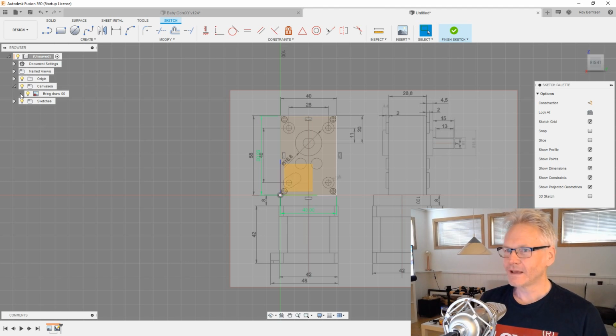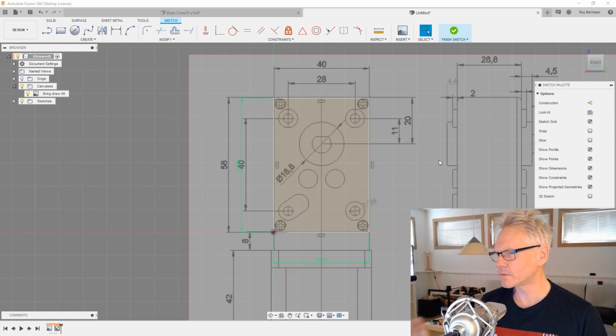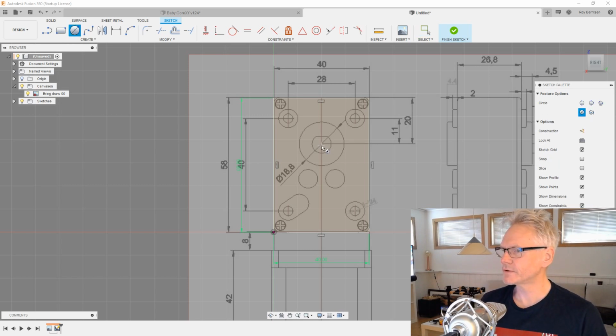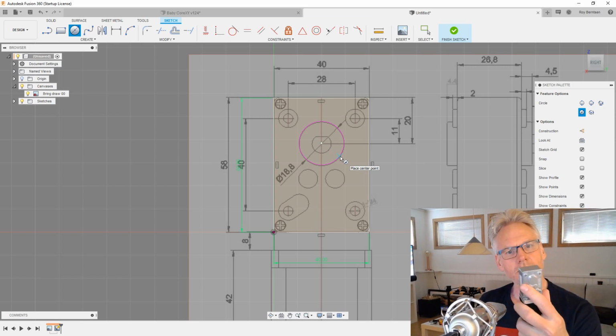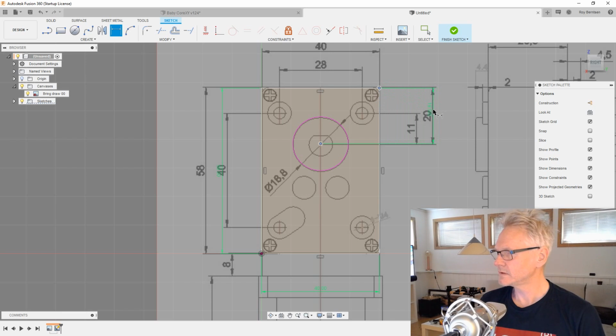Okay, so let's turn off the origin, because that's kind of annoying to watch, and you might want something more going on in this sketch. We probably should do a C for circle and try to add this guy. We also want to watch our WormGear to see what's going on in 3D, because it's not always easy to see that in 2D as we are in sketch mode. And we want to add this guy, 20, and of course that is going to be in the center of the rectangle, and we can constrain that just with a line, which is kind of nice to use, so we just use L for line and just hover over the top line here.